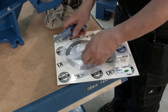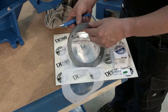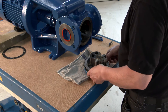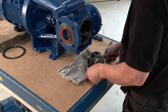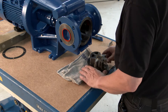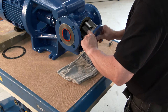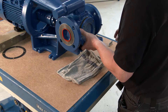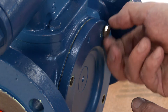Unpack the gasket from the spare parts kit and fit it to the front cover. Be careful not to destroy the gasket as it's fragile. Before fitting the new gasket, clean surfaces properly. Fit the front cover making sure it has the correct position, then tighten the set screws in the front cover.